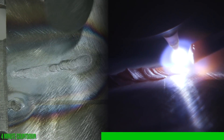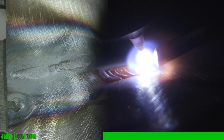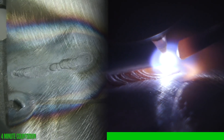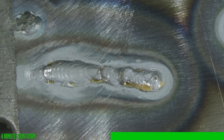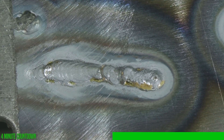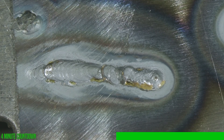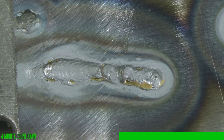That's what we're doing here. Then I came back on the base metal, tried a different way, and it still wasn't working. That's the front side. The back side — that's how bad that is. That's the penetration, not the front side — the penetration. That's pretty bad. So let's go ahead and I'll show you the right way with the right tungsten and the right filler wire.